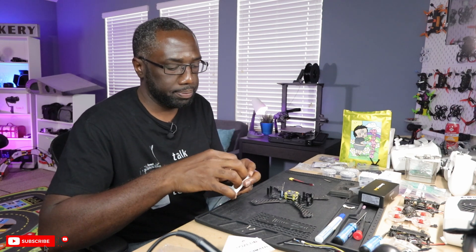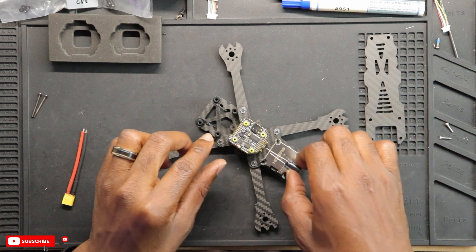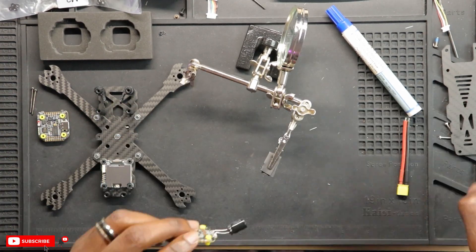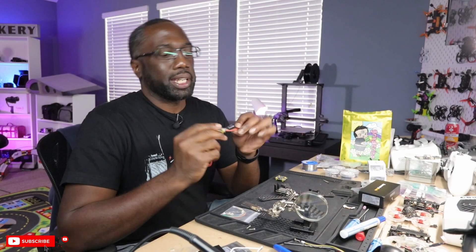Here's our VTX — it is small. I think it could fit. This VTX is so flat and low, I could just mount it right on top. That looks good. I'm just going to solder this capacitor and battery lead to my ESC and go from there. We have the capacitor and battery lead secured and soldered to the ESC — this looks really, really nice actually.